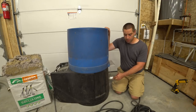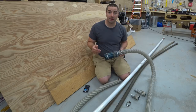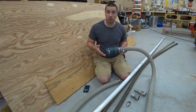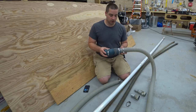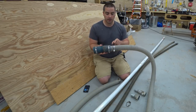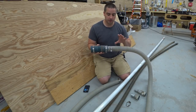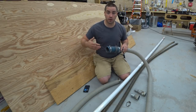On this machine it has a two and a half inch output port right here. From here you've got to hook up some hoses, so let's talk about the hoses to get the insulation where you want it to go. Depending on what you're doing — whether it's an open blow or a dense pack — you may have more or less length of hose or a larger or smaller diameter. In this case we have a short section of two and a half inch inside diameter hose to connect to the machine, then a small reducer and a length of two inch inside diameter hose. I have several sections so I could extend this out to up to 150 feet.